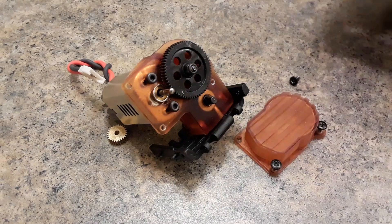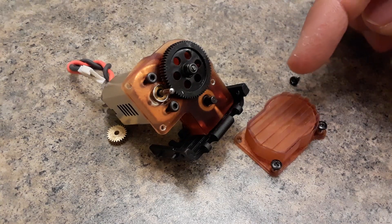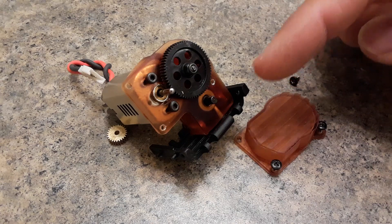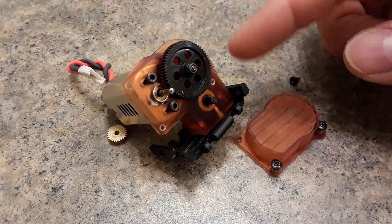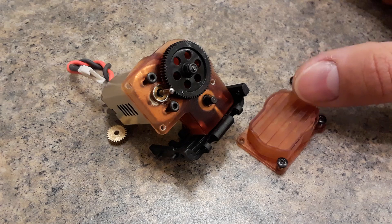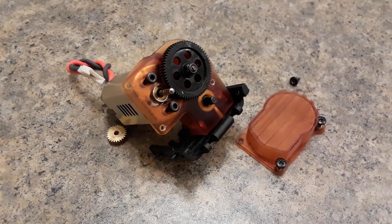You can go from crawling to moving faster — that is a real upgrade. You also have the ability to get different turn motors, really fast or really slow, so that's another place for adjustability that you don't get with the CR24 gearbox or RC four-wheel drive. Those setups use the smaller can motor which has already proven not to be strong enough to both crawl and go fast. With this setup you'll be able to crawl, go fast, and it's not going to overheat. I think I can make it for $15, so I'm going to post it on my Shapeways store — just look up Gamme RC and it'll be there. Thanks for watching!